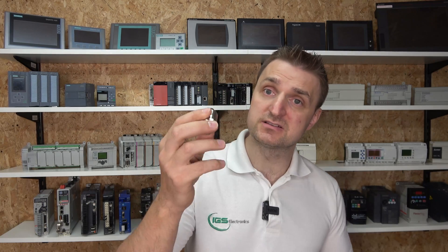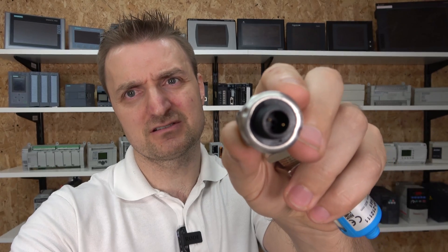I have a two-wire sensor here — it's a current transducer with two pins. And then we have a four-wire sensor with five pins, four of which are used. This one here is marketed for Siemens and it's a two-wire pressure sensor. It's wired absolutely differently than a four-wire, even though they both do the same thing.